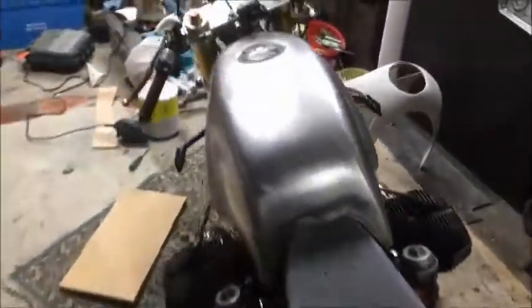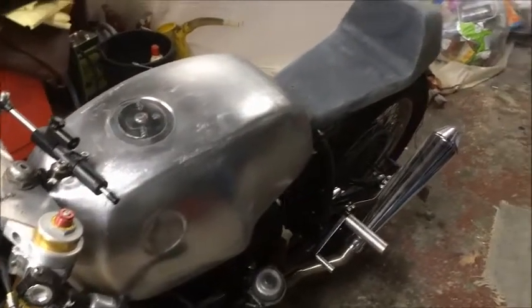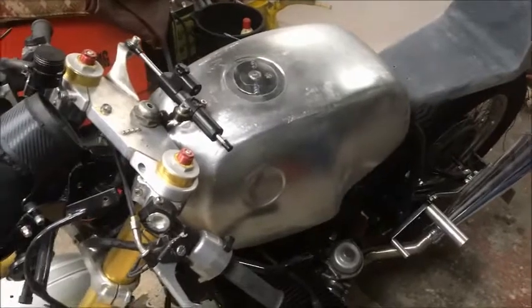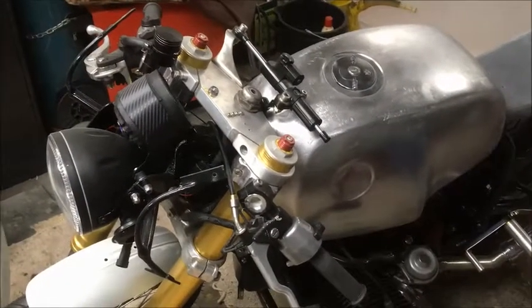How did I take the paint off? I did it with a paddle wheel, very carefully - took the top of the paint off, took all the paint back, and then smoothed it down further with a little mouse sander. I've gone down to around 180 grit and he's going to deal with the rest of it hopefully. I'll give it to him Friday and I'm away for a couple of weeks, then I'm away with work and all sorts of things.